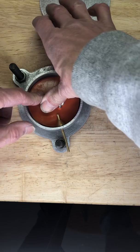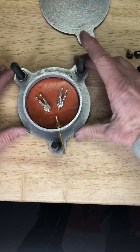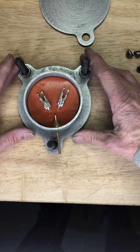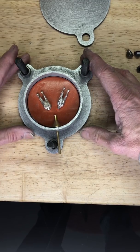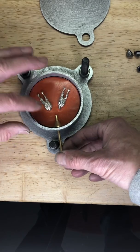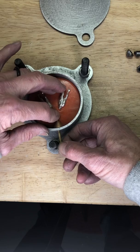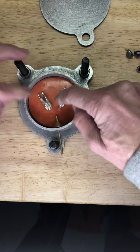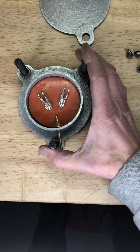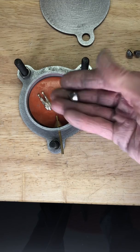The great thing about this type of mold rubber — it's a vulcanizing silicone rubber — is that after it's vulcanized and you've taken the mold apart, you can actually take a ball burr and cut the rest of that sprue in without having to go in and solder anything. It's a much, much easier system.